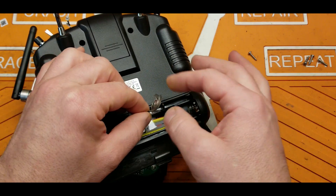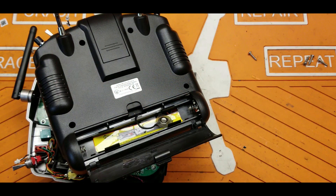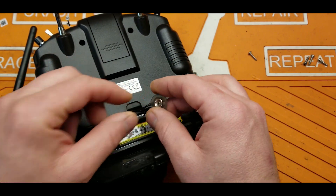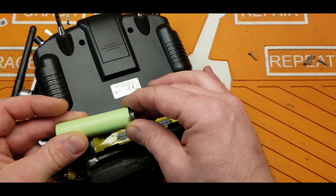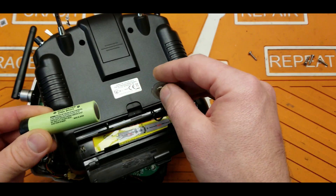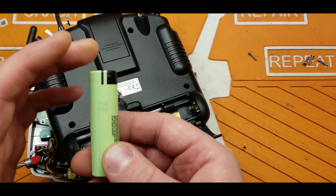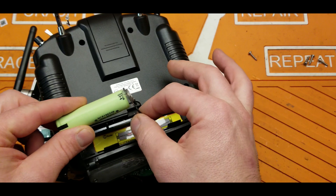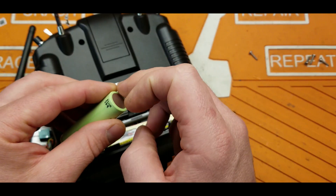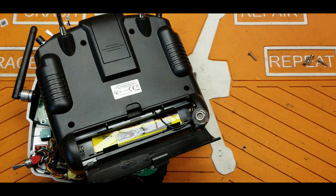They did the smart thing. URUAV put out a charging mod for the original X9 Lite that didn't balance the two 18650 lithium-ion batteries — very, very dangerous. I had made suggestions to Banggood to add my instructions to their website. On mine it was just a soldered-up piece of wire, but this is really nice — they did a good job with this balance port. It actually has a magnet on it to hold onto the 18650 battery. Note that your batteries need to be 18650s with flat tops, not button cell style. If it doesn't power on, this contact may not be reaching your cell — you may need to trim some heat shrink off your battery to make a good connection.